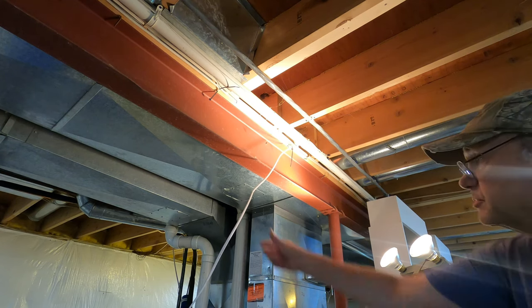The reason for that is that I tied the common on those contacts, the yellow wire, to the 120 volt feed that's always hot. And since the relay is not energized, the normally closed contact on the other side of that, because hot is common, I screwed up. The output of that normally closed contact is hot.